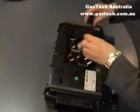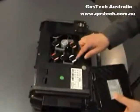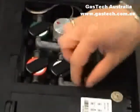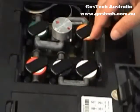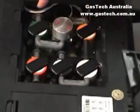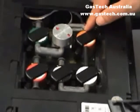The back is where the sensors are. We have the carbon dioxide infrared sensor. The white one is the oxygen sensor. The black parts are just the heating elements to keep the sensors at a certain optimal temperature. The tubes are patented Testo designs. The black one is the nitrogen dioxide. The red one is the carbon monoxide with hydrogen compensation. The green one is the sulphur dioxide, and the orange one is the nitrogen monoxide.